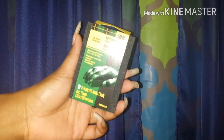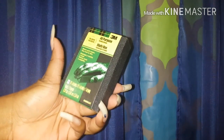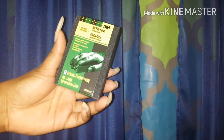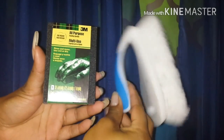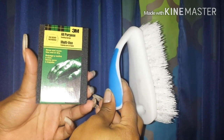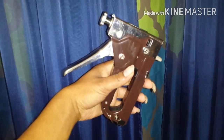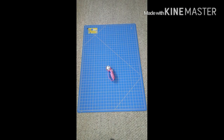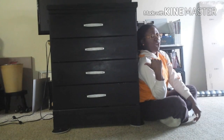To apply your nail head trim you're going to need a rubber mallet, not a hammer — this is rubber. An iron, though this is completely optional. I would suggest getting a sand block so that you can sand your surface down, especially if it's glossy, so that the polyurethane sealer will adhere your dresser and your fabric together. After you sand down your surface you're going to need a scrub brush. Also a heavy duty staple gun, your rotary cutter and mat, and whatever staples you have on hand. And of course you're going to need the dresser.